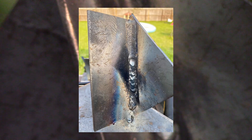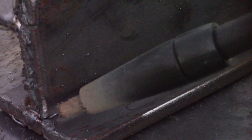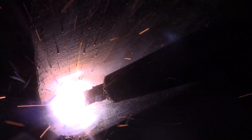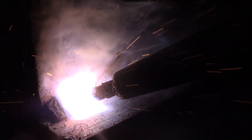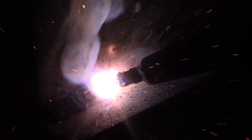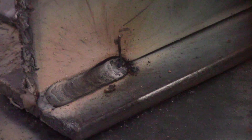This is what I actually mean by sticking the metal together. Here's my top-down and bottom-up — I left a little gap in the middle. This is quarter-inch material; I picked the machine up to almost the highest setting, around 9 on voltage and 9 on wire feed. Here's a straight drag — not doing anything but going slow and steady. Any movement you see is just my natural motion. The breaker tripped right there, so that was as far as I could go with straight dragging at almost the highest setting on this circuit.